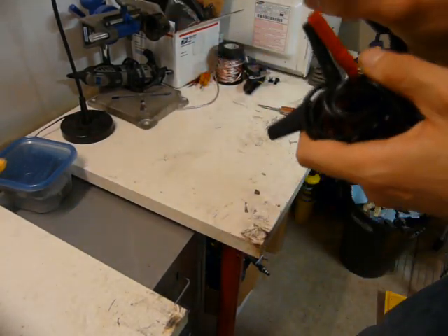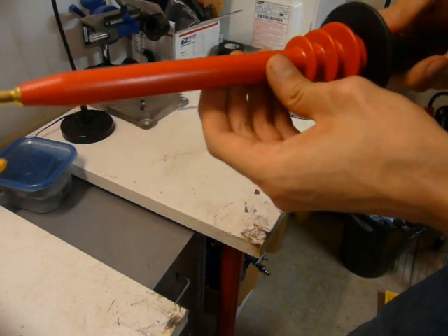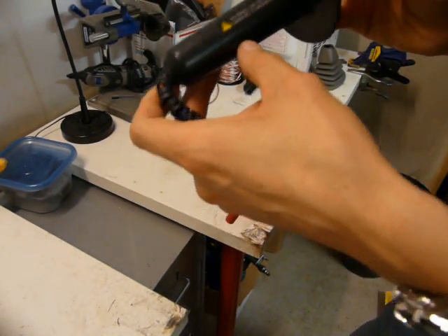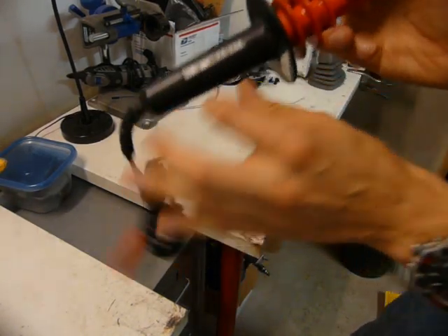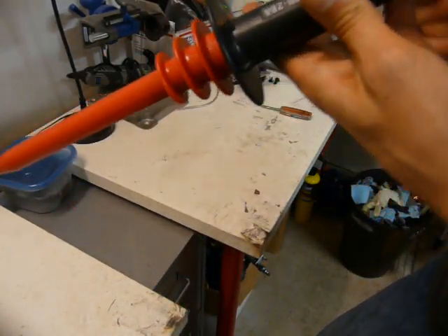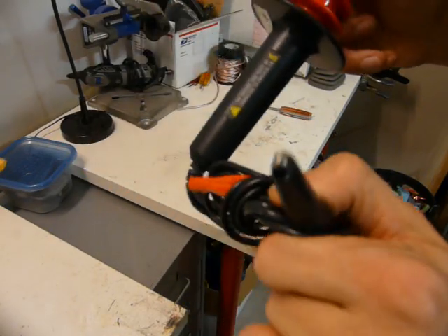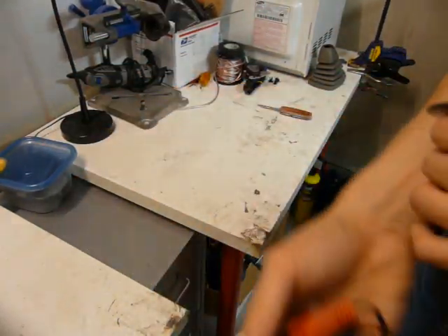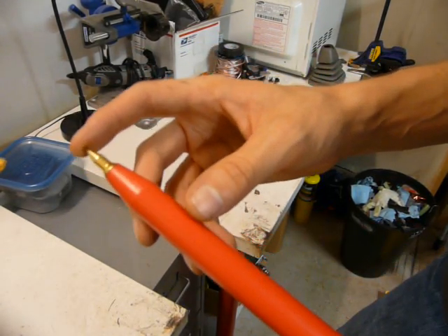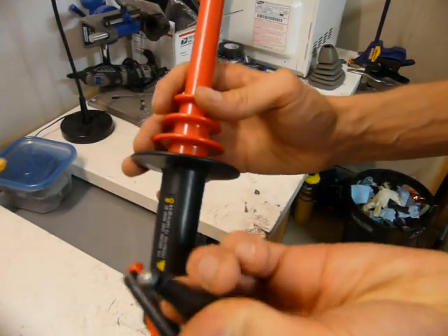It doesn't say what it's up to in terms of volts — you'd think it would say right there. It says a serial number. Ground lead must be connected to Earth. I think it might be 28 kilovolts. I definitely checked before I bought this that it would easily handle the 4,000 volts that this thing can put out. The fact that it says ground lead must be connected to Earth is very important, because this is just a voltage divider from your tip to ground. If ground isn't connected, the voltage divider is not going to divide much — it's actually going to make your test equipment float at whatever voltage is present on the tip. So that's quite dangerous.